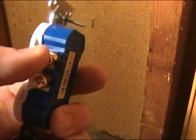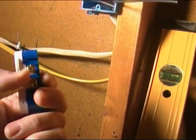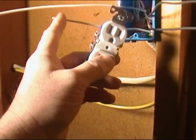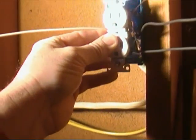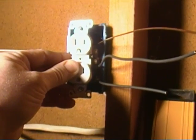When we go to our outlet, we can hook up because when you join them here, it's actually connected through the outlet. So we're going to strip back both black wires, hook them and screw them to the brass post on this side of the outlet. We'll do the white wires the same way — strip them back, hook them around the silver post, and tighten them down. Then attach our ground wire to the green screw, shove the outlet into the box, tighten it down, and everything is connected.